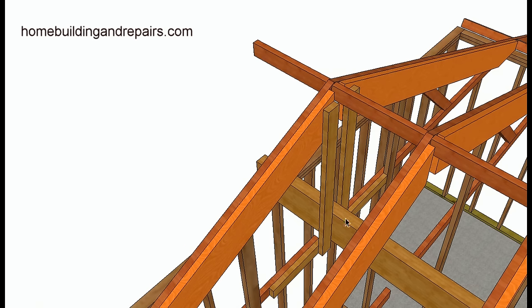You can always notch these rafters to go over the beam and sit on top. Once you nail the rafters to the trusses, you're getting the connection to go all the way through. These blocks right here are also part of your roof sheathing diaphragm nailing, so I don't recommend removing these blocks unless you are going to remove the plywood and re-nail it so that you can maintain your roof sheathing diaphragm nailing.